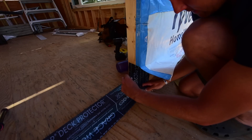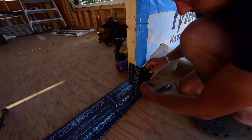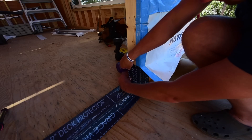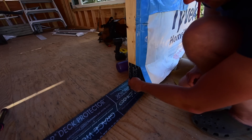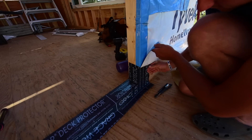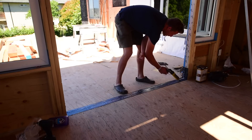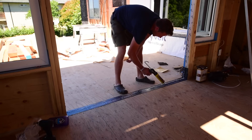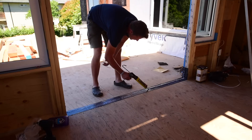Pay attention to the way I'm cutting this. I cut the first one so it cut right up here and then that flap folded over there, and then this one folds over here — I cut it along the bottom and that flap seals that joint. There's absolutely no way water can penetrate anywhere along this joint now because it's been folded over twice in both directions. Before installing exterior doors, once you've got your membrane on, put a nice big bead of exterior-grade sealant caulk — I use Supra, it's what the gutter guys use around here, a super sticky silicone kind of stuff. When you set the door it seals right down into that and creates a barrier that no bugs or water can seep in underneath.